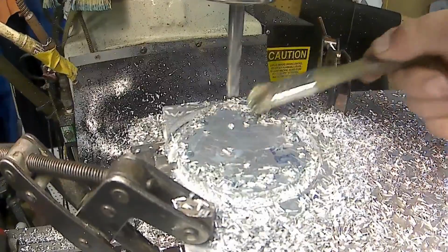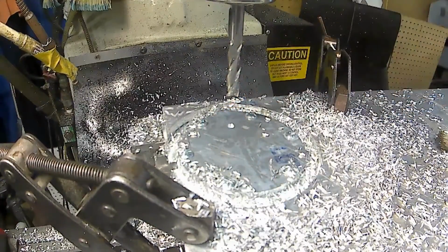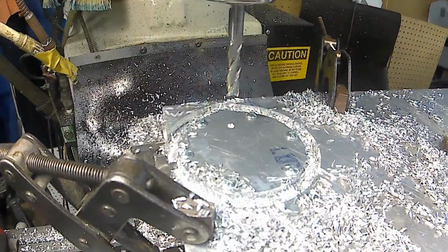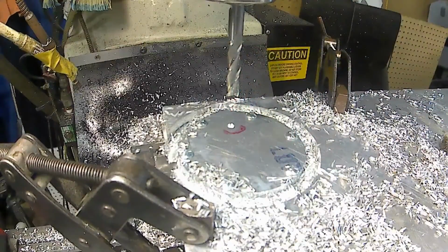So what I have left to do on this is right here, a window gets cut in for the Hall effect sensor. Goes right in here. Just a little window here that gets cut in. That'll be cut with a 93 thou end mill, so I'll have to change end mills and clean up, vacuum up the chips and get the piece off of here.